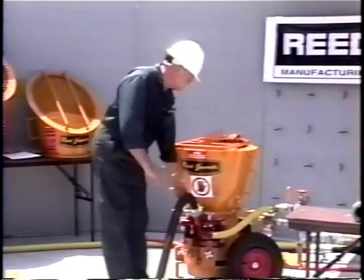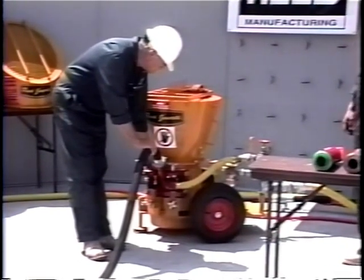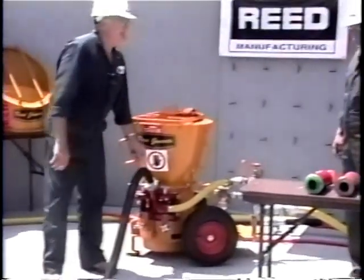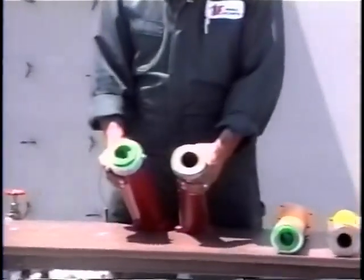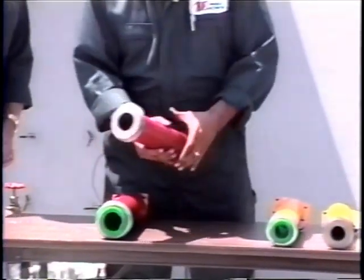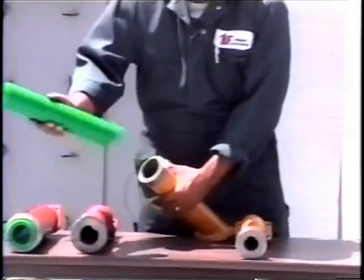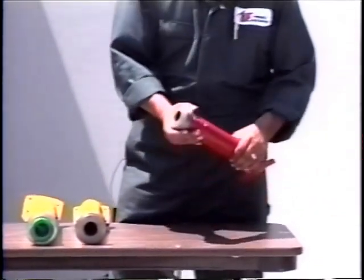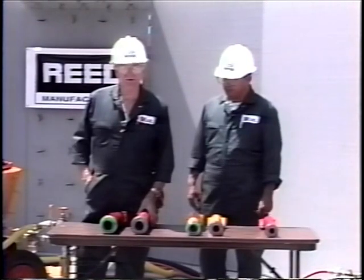Various cone outlets can be adapted to the same machine where the material hose is hooked on. The main thing is to make sure the cone plate bottom matches whatever rubber pad, wear plate, and bowl assembly you are using. There is a wide range of goosenecks available: the two-inch comes in either a liner type with a removable liner for replacement, or solid steel. The inch-and-a-half works the same way. For inch-and-a-quarter or below, just solid steel for lower-volume material spray. Keep the ID of the outlet cone the same as the material hose going to the nozzle man.